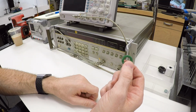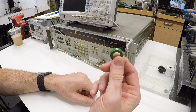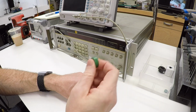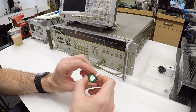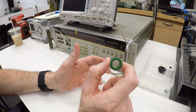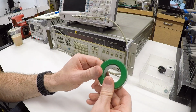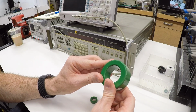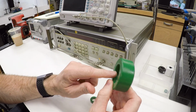And more recently on the mill spindle, I used a much larger choke in a plastic bracket that was designed specifically for VFD outputs, and wrapped the wires around that when I wired it up. And those are pretty expensive. The one that I used on the mill spindle was like $130, though I found them on the secondary market, maybe gray market, hard to tell, for like 30 bucks. But there are all kinds of large ferrites like this one available on eBay and Amazon for $12, $13.